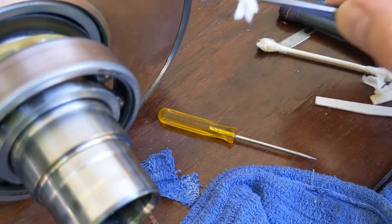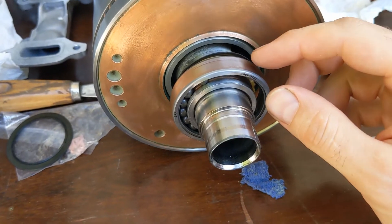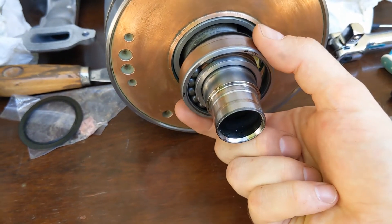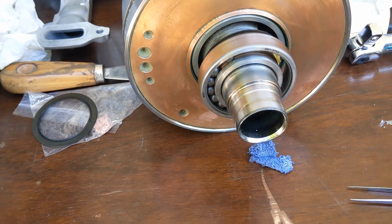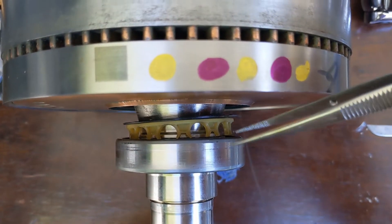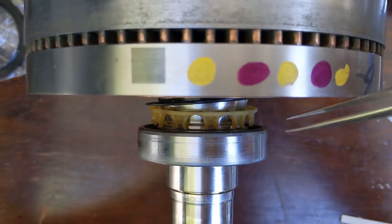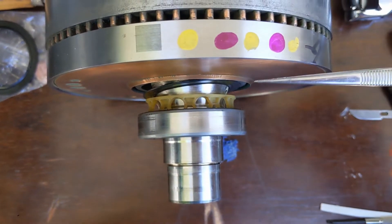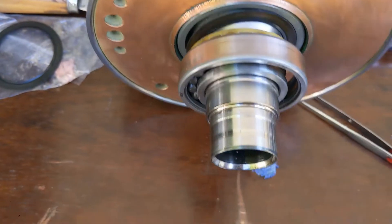You can grab tweezers and a piece of cloth to get into all the tiny corners to clean it. You might ask why I'm leaving these bearings on the rotor. With a normal bearing puller you pull on the outer race and the balls can get damaged, so generally you should use a new bearing after that. Ideally you need a bearing pusher that pushes against the inner race. There's only a very small surface area to push against, and there's not much space between the bearing face and the rotor face. I don't have that kind of tool.